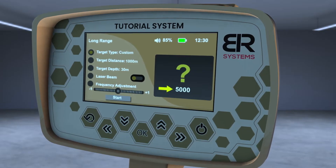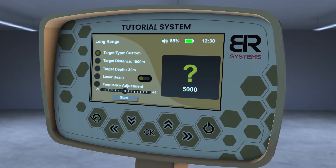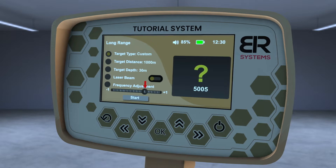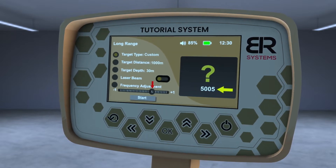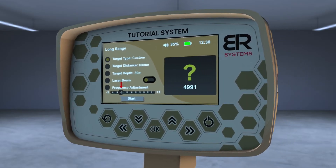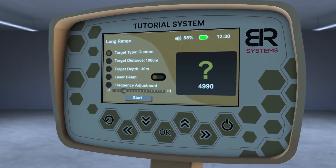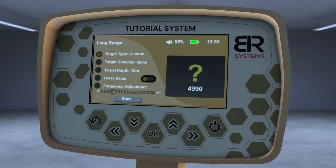You can decrease or increase the search frequency by a maximum of 25 hertz plus or minus, and each degree of frequency change adjustment is about 1 hertz. For example, the main frequency of gold is 5000 hertz as a default value. If you set it to plus 5, the frequency will increase by 5 hertz to 5005 hertz, or if you set it to minus 10, the frequency will drop from 5000 hertz to 4990 hertz. The user must change the setting and save it when getting the strongest response from the buried sample.